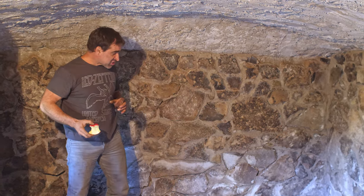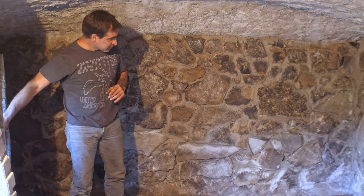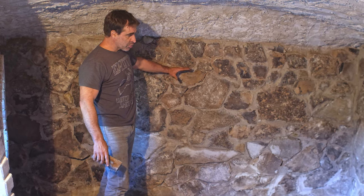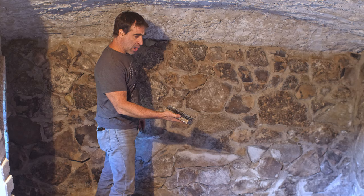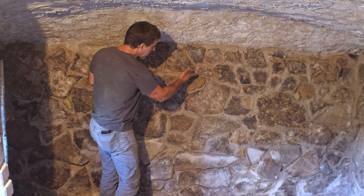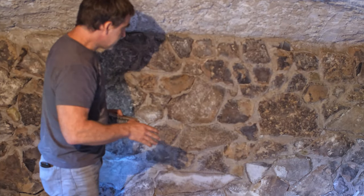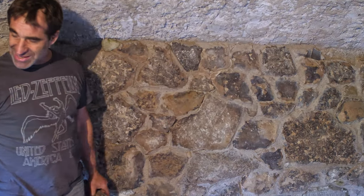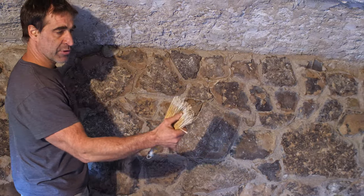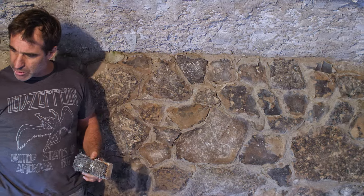Twenty hours have elapsed since we were last here — it is the next day. I pointed my joints and now I come in with a wire brush just to brush them out and create some relief. I want to brush them back, go in with them a bit. I will either brush with the wire brush the day after, or if I can come back two hours later I'll do it with a corn broom on the wetter joints and go in that way — either way it's a similar result.